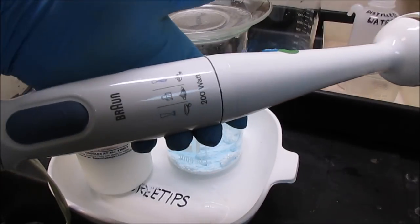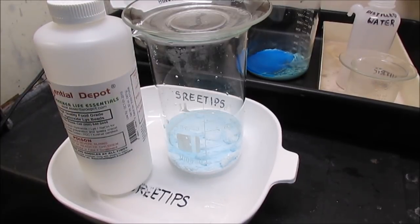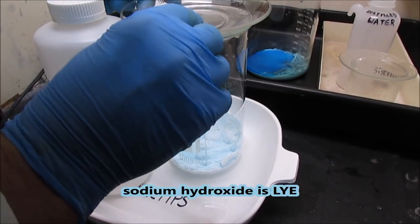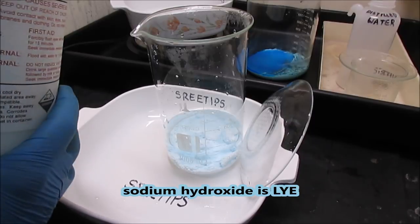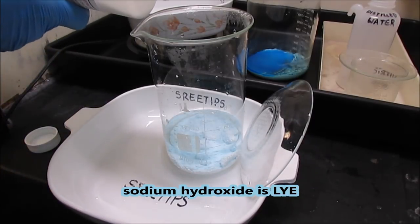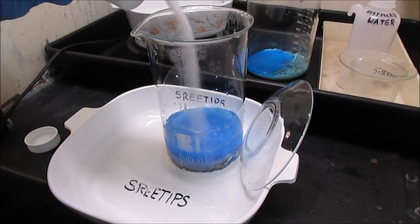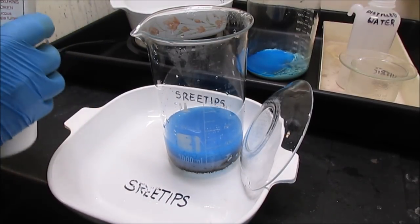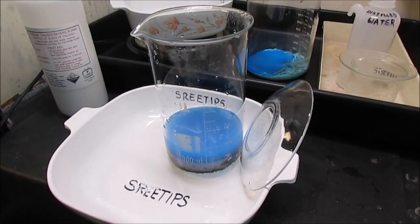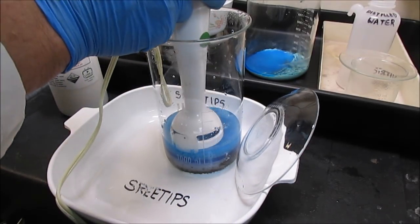This is the silver chloride recovered from the silver brazing rod — I'm going to transfer it to a tall beaker to convert it to pure silver metal with lye and sugar. I've got a handheld blender from the thrift store with a little blade on the end. I've got some sodium hydroxide — I'm going to dump some in without measuring. We're going to convert the silver chloride to a black-colored silver oxide. You can see at the bottom it's already starting to turn black. Here we go with the blender — it's the first time I've done this so we'll see how it works.